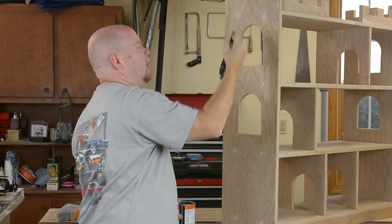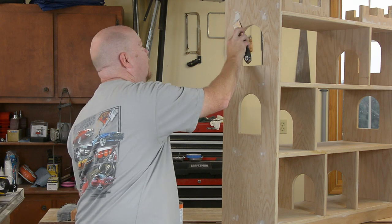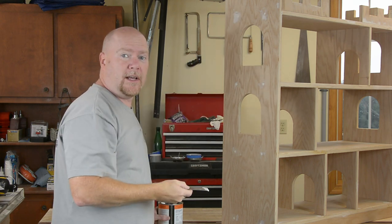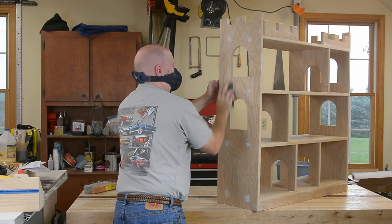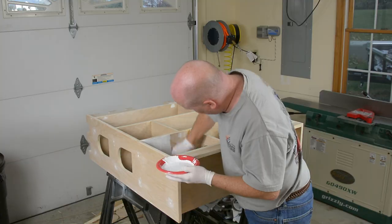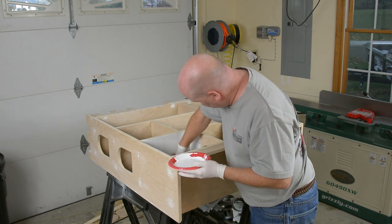A combination of plywood and screws and nail holes means one thing: filler. It's probably going to take two coats — I'm on the second coat here — because no matter what filler you get it's going to shrink a little bit, and it might not look that bad after sanding, but when you spray paint on it those holes will stick out like a sore thumb. Once the filler's dry you can sand it back flush, and if done right it'll disappear under a coat of primer. I'm using Kilz white latex to cover up this plywood completely.